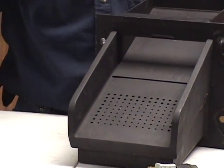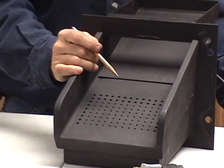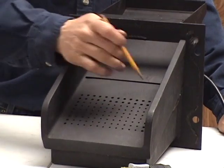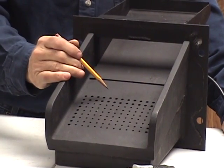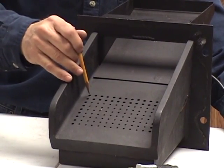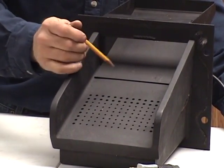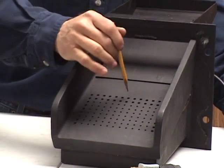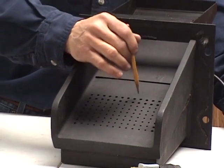The other thing that you have to do when you clean up your furnace in the spring is you've got to clean out all these air holes. You can just take a little finishing nail or just any kind of a little piece, even an eighth inch drill bit, and poke down through each hole, all the way through every hole.